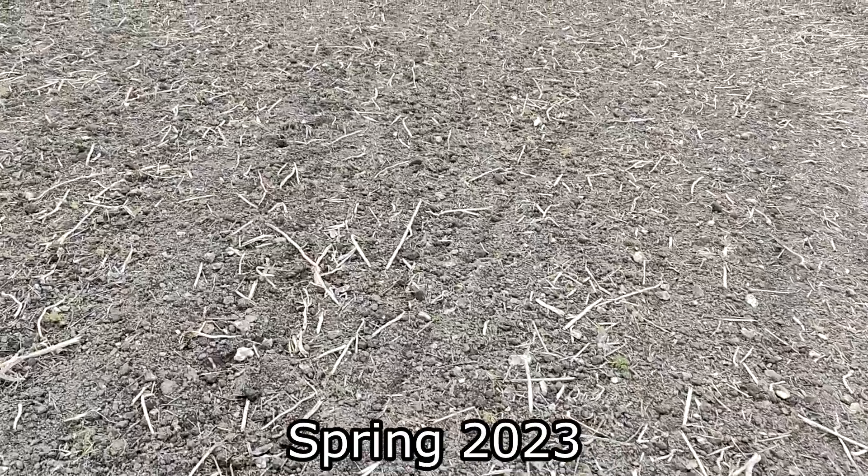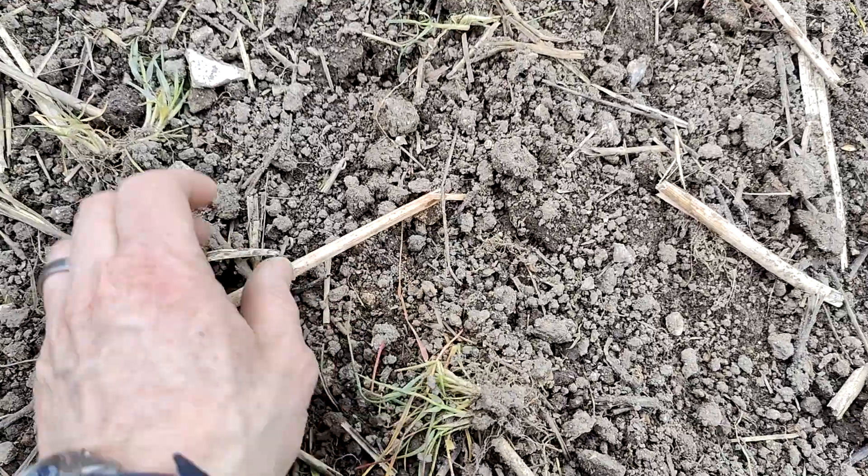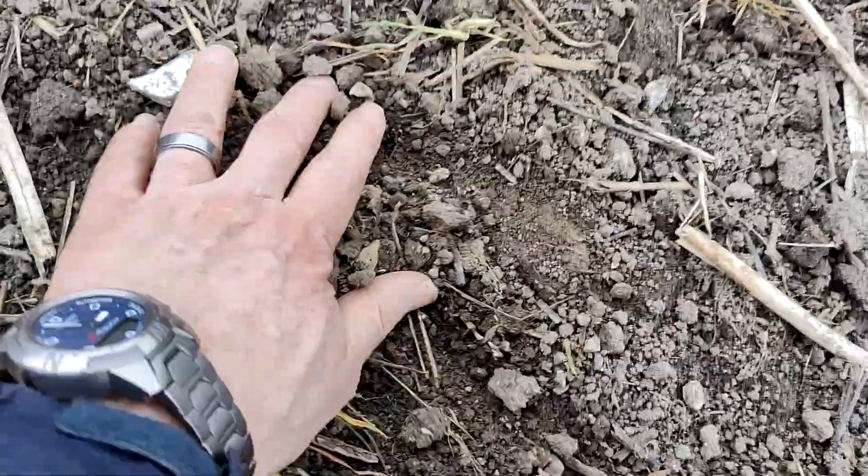Building on those results, we did a carrier pass — glyphosate carrier then drill — in some spring wheat last year pre-drilling. We also went through with a weeder to generate a superfine crumb before rolling. After the carrier pass we came through with the weeder once more, just dislodged a few more black grass plants, moved them around. It generated a very fine crumb and drilled really nicely.